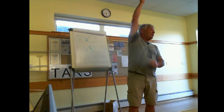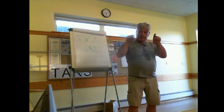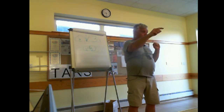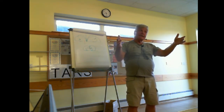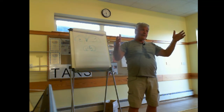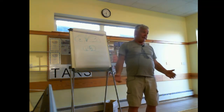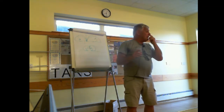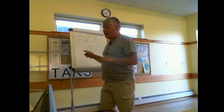And I mean, even if you put it on a mast, it says, oh yeah, mast mounted, and they give you 6 or 4 or 3 little things that are barely that long. Well, again, that's not a 20 lambda ground plane. Again, barely 1 lambda. It's probably more like half lambda, and it's all going to go like that. So your 6 dBs isn't going to go anywhere. So be very careful what you do.